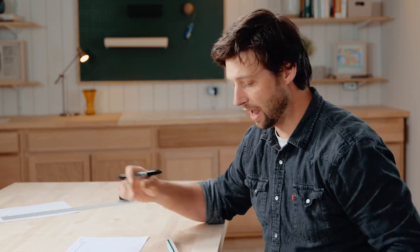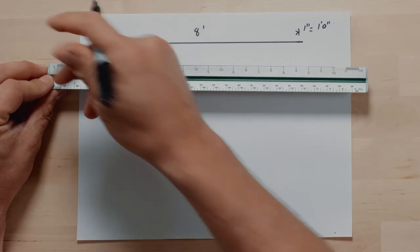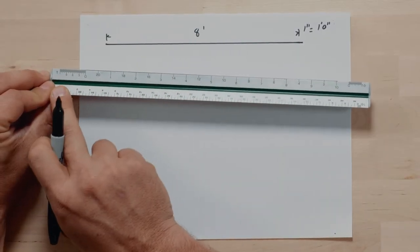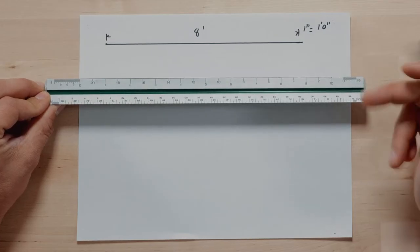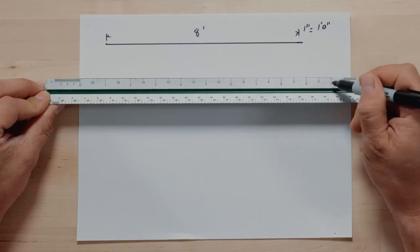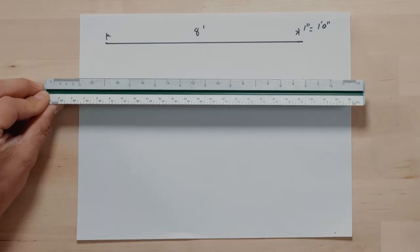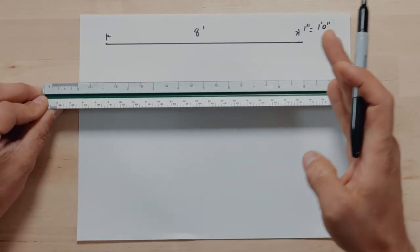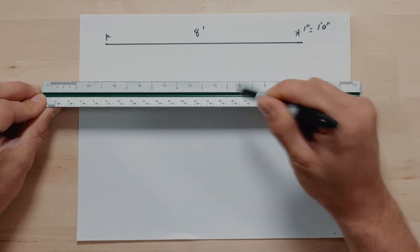Now, like we talked about, sometimes that's not going to fit on your page. So on this same side we have the half scale that correlates to the full scale. On this side we have one inch, and on the other side you have half inch equals one foot. You can see all these smaller graduations — zero — and then it says ten. Well, that's really your first mark from the full scale. So when you're counting this way, that's one: one, two, three, four, five, six, seven, eight.